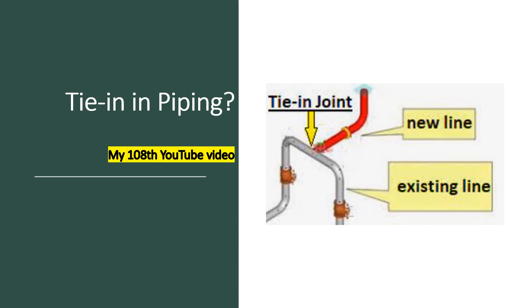If you want to do a tie-in, you have to isolate many things for the existing line. Then you have to connect the new piping with the existing piping and maintain the integrity of the joint. At the same time, you have to make sure that the existing piping — which has already been in service for a few years — and the newly installed line match with each other in properties and class. So tie-in is considered very critical and usually a specialized team works on it.